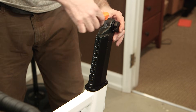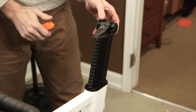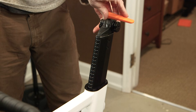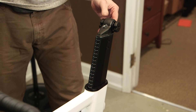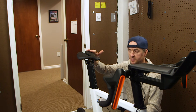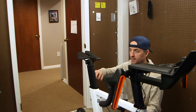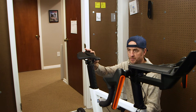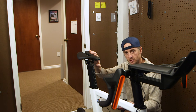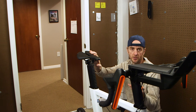I really don't know why Zwift didn't do this — it wasn't particularly difficult. The Zwift bike has some pretty aggressive setback already, so adding a little bit of adjustability is really beneficial. I did end up removing about 8mm of material from the seatpost, which effectively lowered the saddle by 8mm. To account for that, when you put the post back in, you'll have to raise it up by that amount. I realize most of you don't have the equipment to do what I did in this video. I'm hoping that by showing you the process, you'll be inspired to come up with a way to do something similar using the equipment you do have.